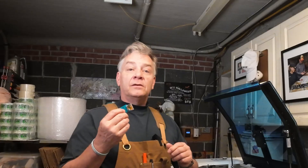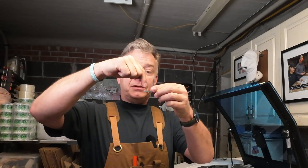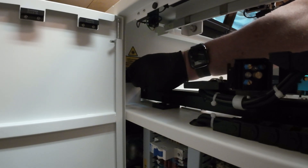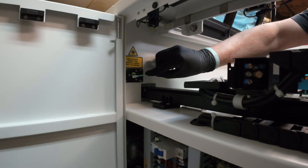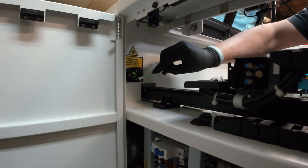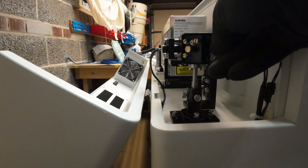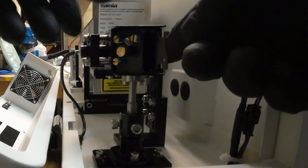Here's my big tip for you. The reason it's so critically important to keep that lens clean all the time is because when the lens is clean, the energy beam — the laser beam — goes through it, hits your material, and does its job cutting or engraving. While you're engraving and cutting materials, especially things like MDF, there's a lot of stuff going on coming off of the material. You find it layers around the surface on the inside of the bolt, but it also eventually starts to pile up on this lens.